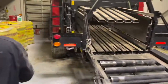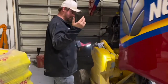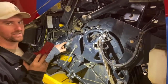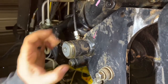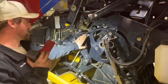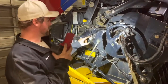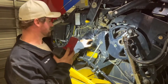This one we're basically done with other than I'm still missing the two side rollers on the plunger for centering the plunger. And I haven't got any of my needle rollers and slacker arm rollers yet, but this baler is basically done. We went in here and deleted the snap ring that was on here. We got it basically perfect - still got a little bit of play in there so this isn't going to bind up, but we have no end-to-end play. As you can see over time it's rubbed on the inside, so that keeps it centered up and keeps it from coming out. I had it lose the snap ring and it came out and this crank arm hit it and bent this arm in here.